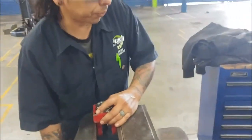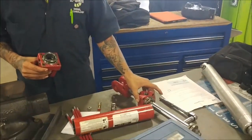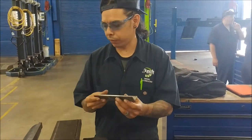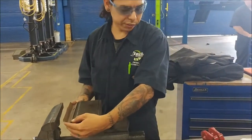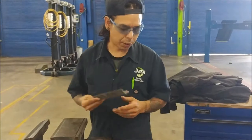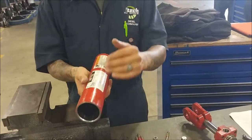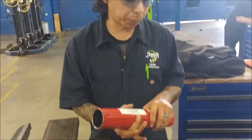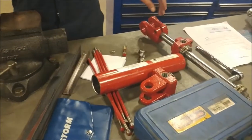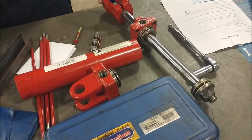What I'm going to do is try to take this clevis apart, take this gland off. I've got a little piece of steel set up in my vise - I'm going to put a little bit of oil in there and put the rod in here to check that it's not out of round or bent. We're also going to be taking some measurements inside our cylinder using our T-gauge to make sure it's completely straight all the way through with no bends or bulges. We're going to inspect the piston rod, make sure the chrome is still intact, no corrosion, no bubbles, no deep scratches or gouges from contaminants and fluid.